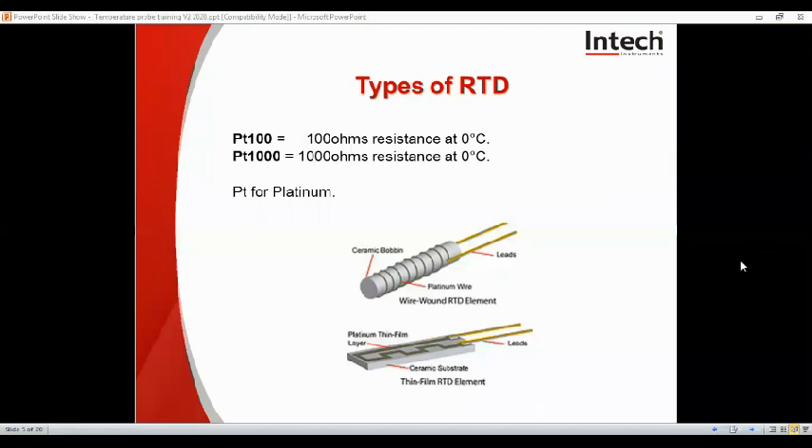The main types of RTD are the PT100 or the PT1000. We can get some rare ones like PT500 or copper and nickel variations like the copper 500 or nickel 1000 for special applications. The PT100 can be wired with two-wire, three-wire or four-wire variable PTFE lead links for varying stem lengths to allow for lead compensation and accuracy. PT stands for platinum, hence it's wire around the element.